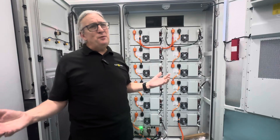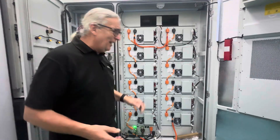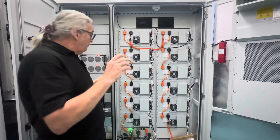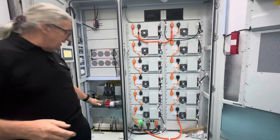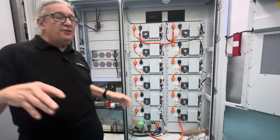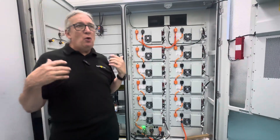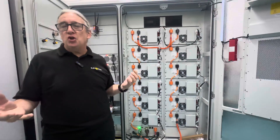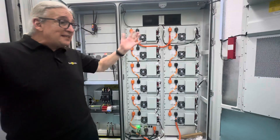In a lot of Europe you don't really need cooling, especially in the UK, because it's always cold and raining — a bit like Hong Kong. From a wiring point of view, all you've got here is your three-phase connections, three-phase neutral, and wiring to it. You have two configurations: in countries like the Philippines you may be on a delta grid with no neutral, whereas for the UK or South Africa you're on a star grid and so you have a neutral.